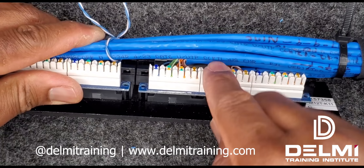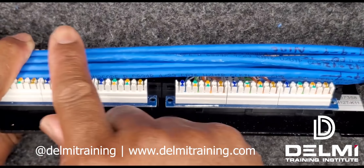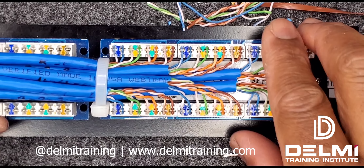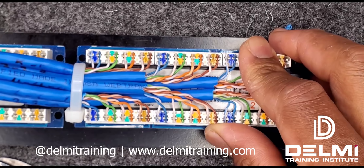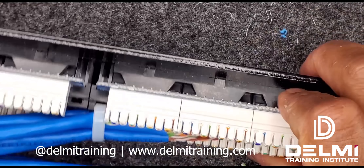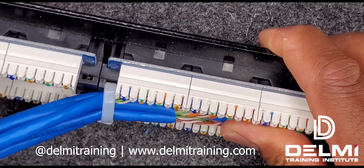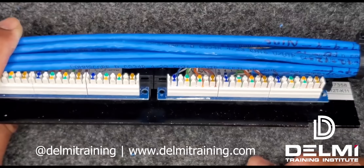My newer cables are going to come in this way. But if I brought my cables from here and started terminating in the opposite direction, the result would be a problem — you don't have adequate room to terminate because the cables end up lying on top of each other. It doesn't give you room to terminate on this side; it's going to be very tight, and the cables start to fall out. This is not the right way to get started.